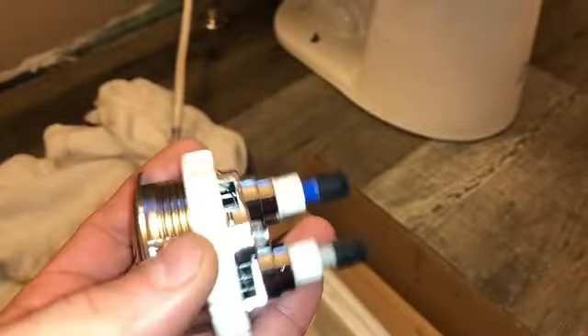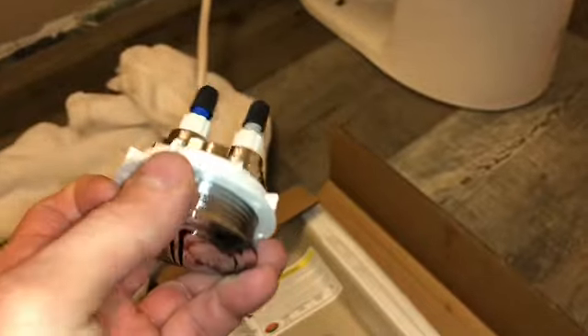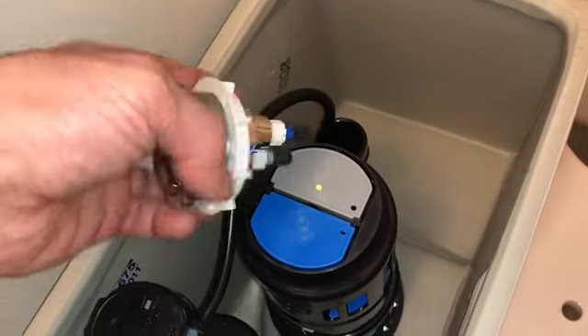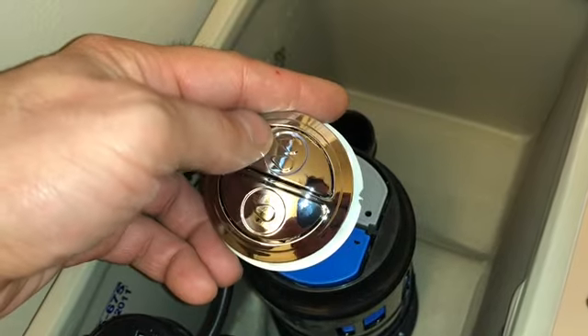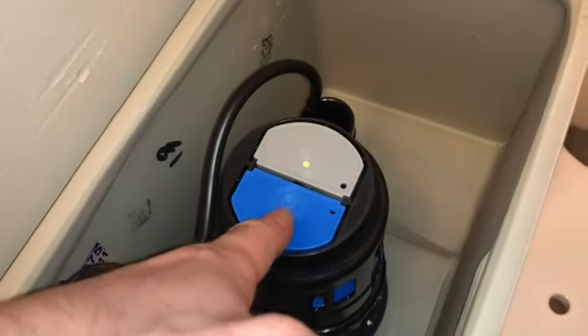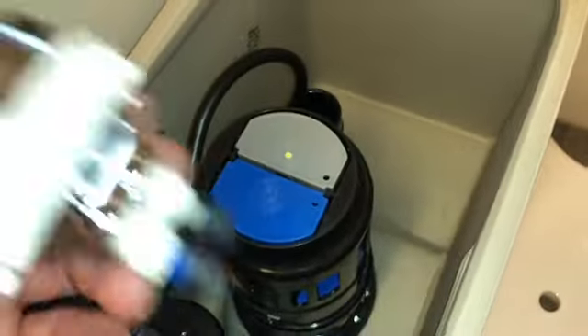This little mechanism here — you can see how this ring unscrews. These two buttons push down on this piece, and it's color coordinated: one button means a single small flush and two means it'll flush with a lot more water. So if somebody just pees you'd use the small one to save water, and the other gives you roughly double the amount.